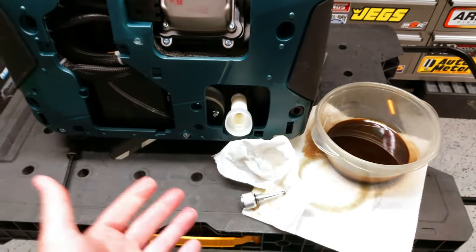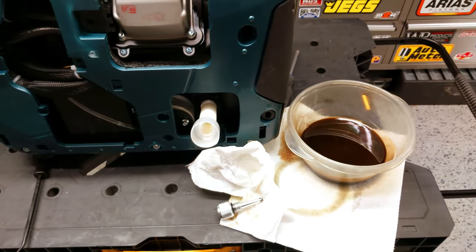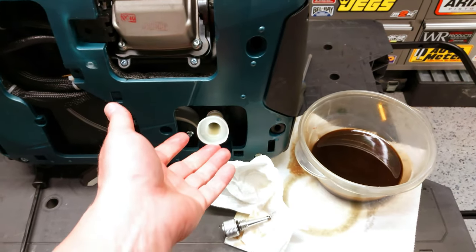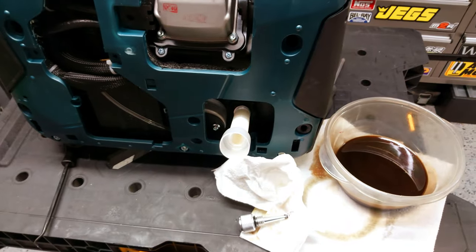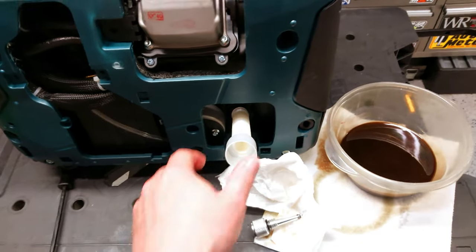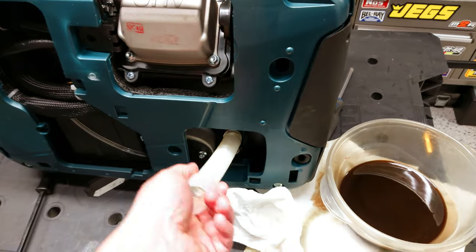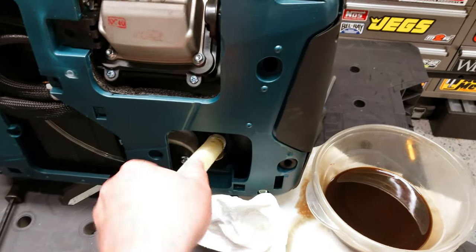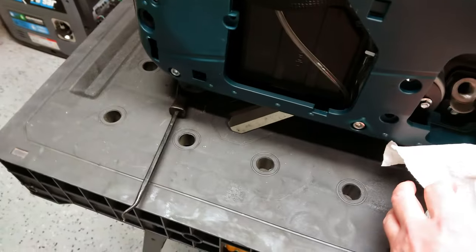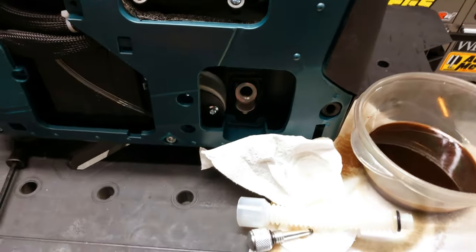And, of course, I did not fill it up on camera. I went ahead and added oil back in, so I switched over to T6 Rotella. And it's as simple as the Pulsar video. You just add it in through the funnel that's included. No big deal. It takes half a quart, so 0.5 quarts. And 0.5 quarts, I can tell you, brought it right to the edge, to the point I had to tip it back a little bit, or it would start to pour out. So if I set it down level, oil will just start to come out.